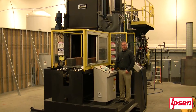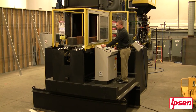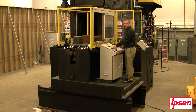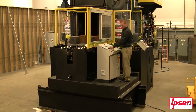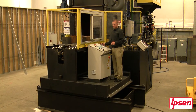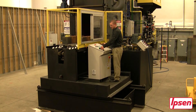The loader has two speeds: fast and slow. The fast speed is used when going from unit to unit. Putting the toggle switch into the right segment, pressing the button on the safety switch and moving the toggle switch forward allows you to go fast. Once you're close to your unit you would like to go into a slow speed to be more fine-tuned in front. Switching your toggle switch to the left, pressing the safety button, and moving the toggle switch allows you to do so.